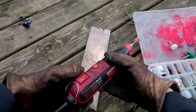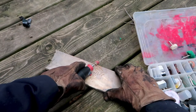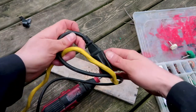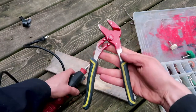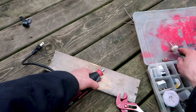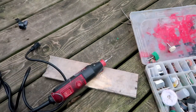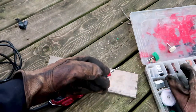Now I put the leather safety gloves back on and I can do some sanding. Now I disconnect again and I have pliers there. The nut is locked because I'm holding the button down and then I switch the bit. Once I've loosened the nut I stick in the drill bit again and it snaps into place. Then I do a quick tighten — a quick twist with the pliers — and the drill bit is tight.